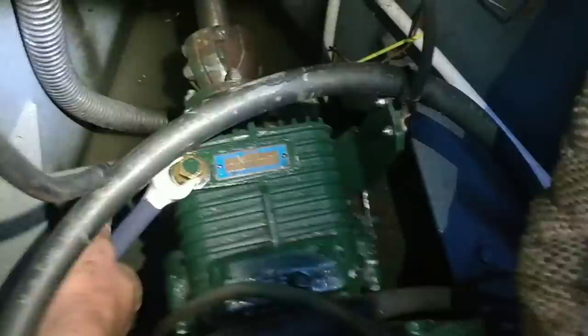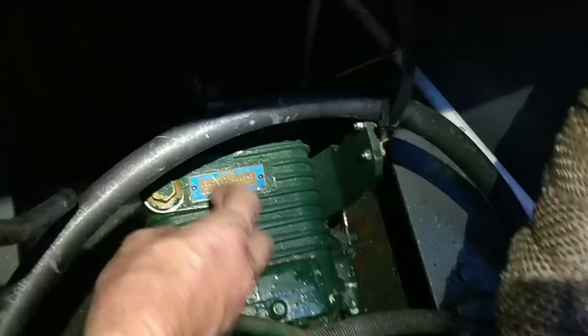Okay, right, onto the gearbox oil next. This is a PRM 120 gearbox, and this nut is an 18, strangely enough. Yeah, it's an 18 nut. There we are. I'll put that oil into a jug and inspect it, and then just put back in what I take out. So it's usually about 500 millilitres, half a litre.